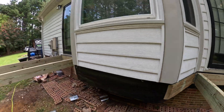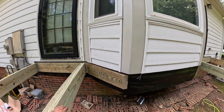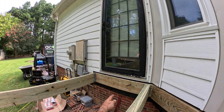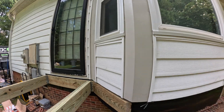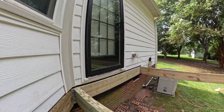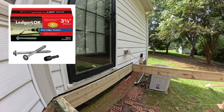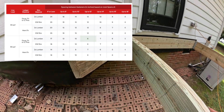Right now what Antonio's prepping is the double beam that's going to go from here to there. We prep all of our lines, 16 on center, put all of our lags in. What we used for this is the ledger lag by Fasten Master — pretty much every eight inches on center, staggered fastening pattern.